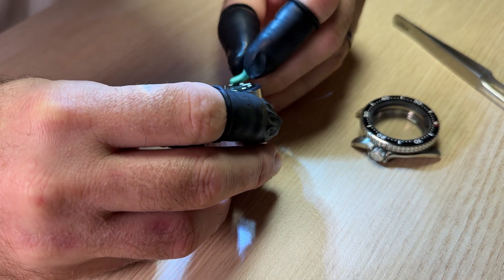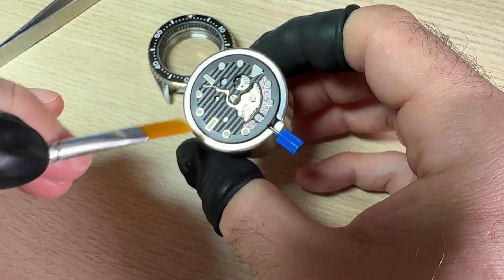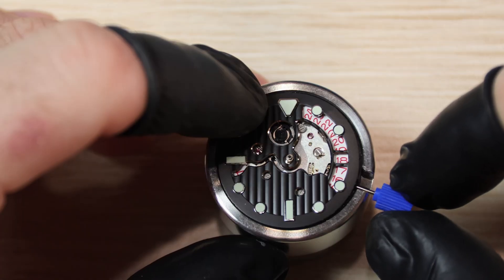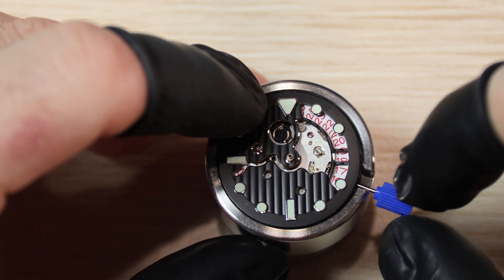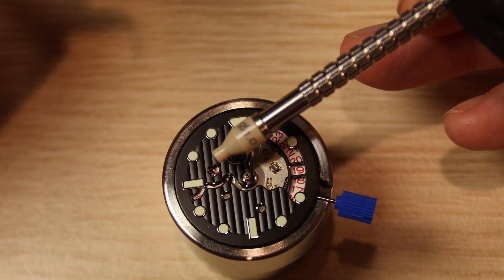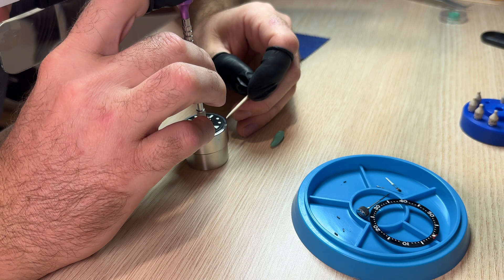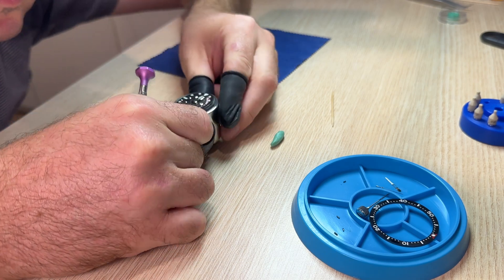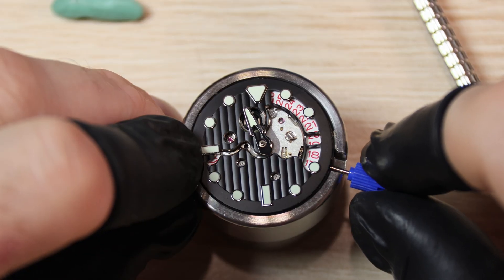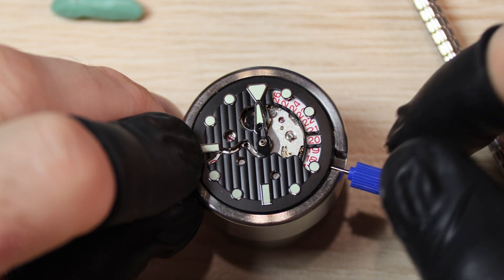Just going to have to make sure we give it a really good clean off. Before we get started on the hands, I like to make sure I get the majority of all the dust and smudges off. I like to use this little brush and this silicone wand, which helps to get all the smudges off all the chrome parts. Before we place any hands, we get the date wheel set to the midnight position, right where the date wheel jumps to the next day. We get our skeleton hour hand and using the 1mm presser, get that set in place. Make sure it's sitting nice and flat and not dragging on the dial. After every hand that I set, I like to check and make sure we're pretty close to midnight — usually within five to ten minutes — and we're bang on.